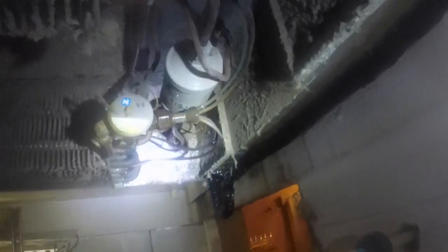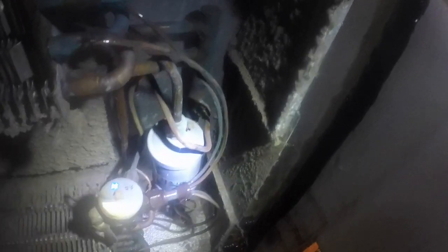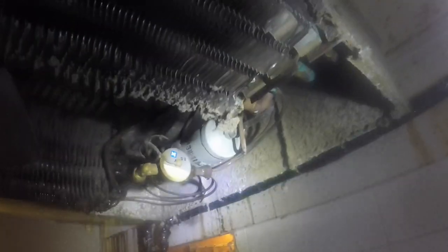I'm over here at this old Hussman coil. I didn't like the way it was cooling. Look what I found — this one feeds air up through the fans and then out the coil. Look — the thing's all plugged on the inside, like mega. There's our TXV — old timer. There's actually a liquid line dryer inside here too — old school. I didn't see that earlier. I'm going to have to pump it down, see if I've got one on the truck, and change that.